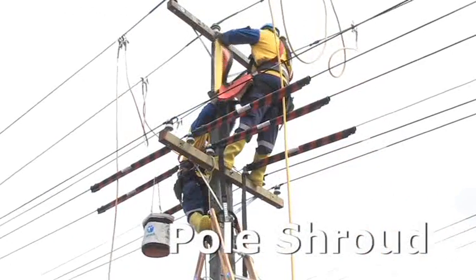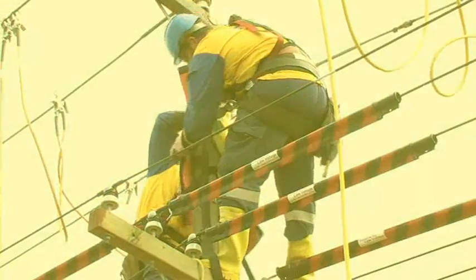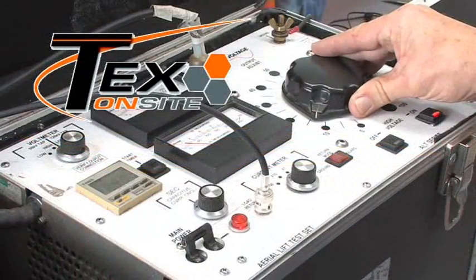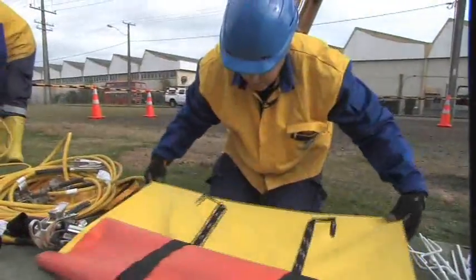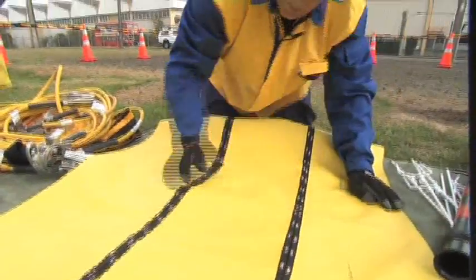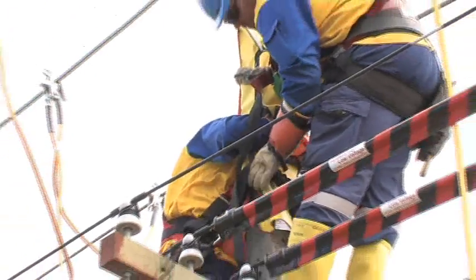The primary role of the pole shroud is to protect the worker from the potentially conductive pole. When used in conjunction with the dielectric boots and gloves, this meets the requirements of the SMEI handbooks. We developed the pole shroud in conjunction with the energy network. It has been tested by TEX OnSite at 10 kV for one minute, giving it a class 1 working voltage of 7.5 kV. Before application, the shroud should be visually inspected to ensure it is free from damage, splits or holes. The shroud has been cut to fit neatly around the pole and arm braces, and if any other equipment such as street lights or stay wires protrude from the pole, the shroud will accommodate these through a Velcro split. The shroud is large enough to fit a double pole if needed.